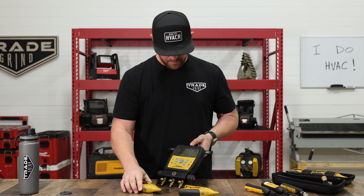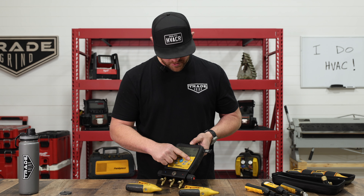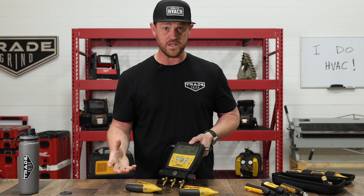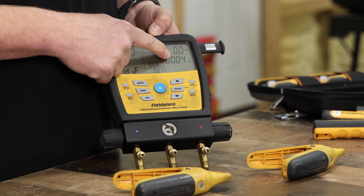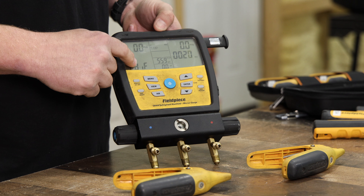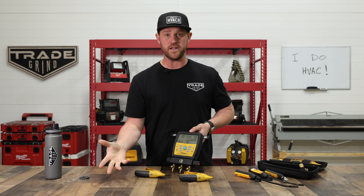You can also change your refrigerants and do what's called a test tightness. Let's say you're pressure testing a system after repairing a leak or doing a new install with nitrogen — you go into test tightness mode, hit enter, and it starts counting a timer while monitoring your pressures. It tells you how much pressure has changed over the elapsed time. Right now it's showing zero pressure difference; if you were hooked up, this number shows the difference from when you started the test. You run the test for 10–15 minutes and it'll let you know. That's a great feature.